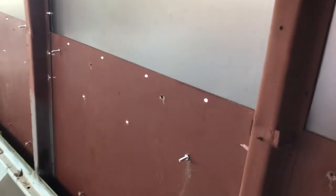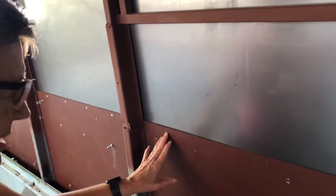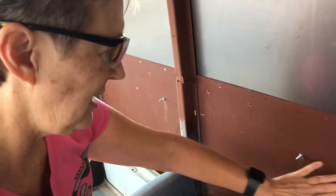So there you can see one of our bolts that are strategically placed so that it holds the sheet up while we do all this drilling. But it's a 3/16 hole, so we can take it out and come back and rivet when we're done. And we have to watch because there's multiple holes in this bus, so we're doing the top row, and then the bottom, and then this row here.